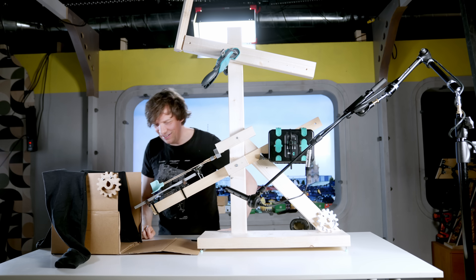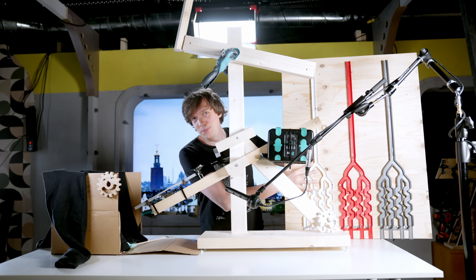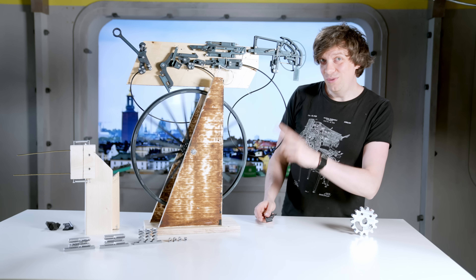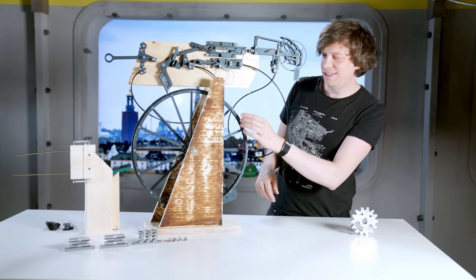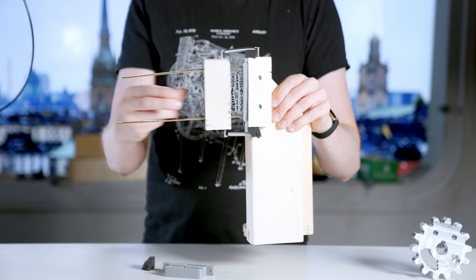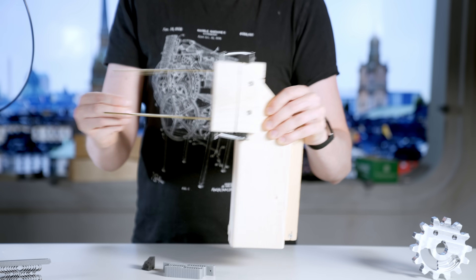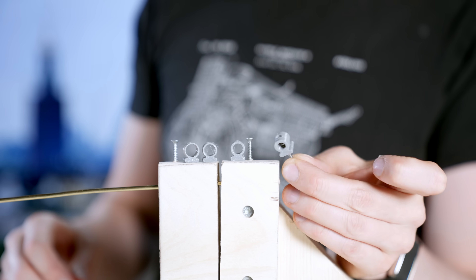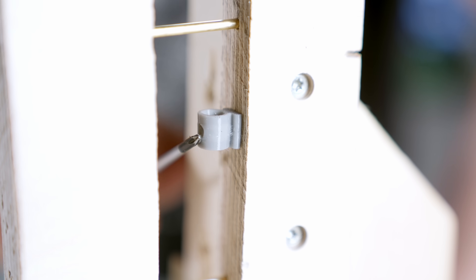The TPU makes the vibraphone sounds better and makes marble transport completely silent. But it can also do other great things — on the machine we'll have a lot of mechanical stops. I made tiny TPU stoppers with a mount for a screw, so we can design and print our own small stoppers. The difference with and without TPU on the stops is enormous.